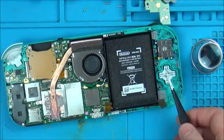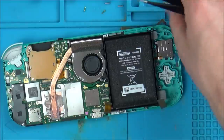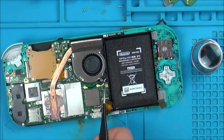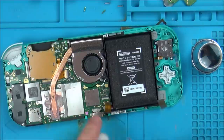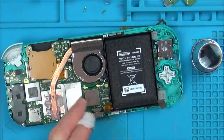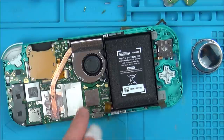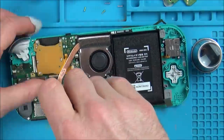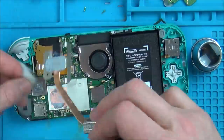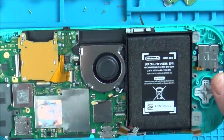Maybe I could just swap this board out here and then prove the fault, and then I could just work on this. But because there's corrosion here, I want to check the other side of the board as well, because even if I was to get it working by just swapping this out, in a few days' time or weeks' time, something else might fail if there's already corrosion on this side here. Yeah, and evidence of corrosion's gone right the way up to here as well.